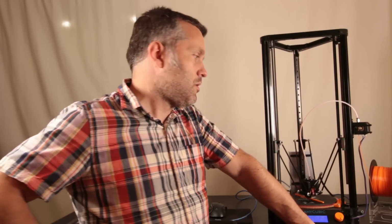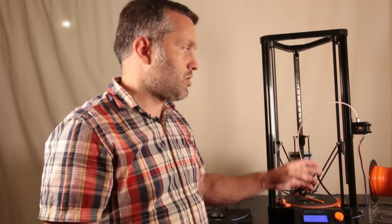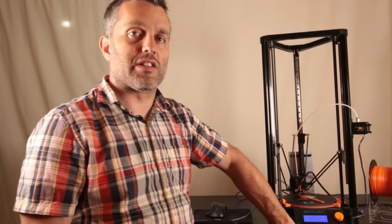That's what we're doing. But I show you a couple of G-code commands to accomplish that. Specifically M211 S0, which disables software end stops. And also just a couple of moving commands. G0 X-70 Y-41, and G0 X70 Y-41. So also G0 Y80. So those are the three movement commands that get you right up against these legs so that you can zero each of those legs.